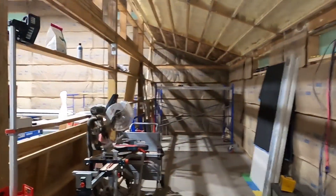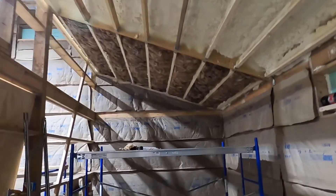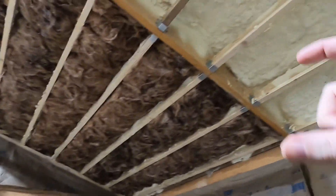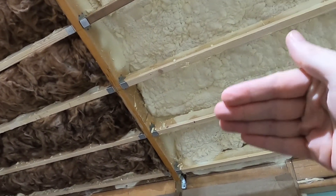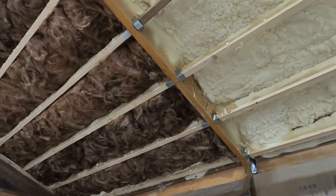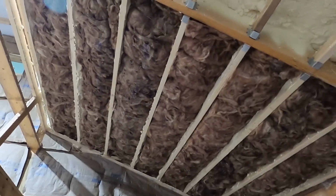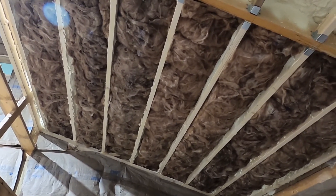While we ignored the snow outside, Robert started a new task inside. We're starting the ceiling for the office. We installed five inches of closed cell foam between the purlins and then down under the purlins — that's about R7 per inch, so roughly R35. Now we're installing fiberglass batts that are an additional R25, hopefully bringing the assembly to R60 or so.